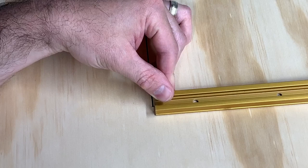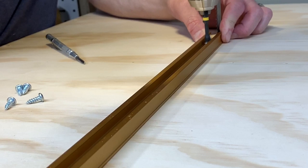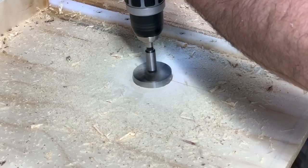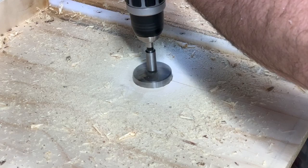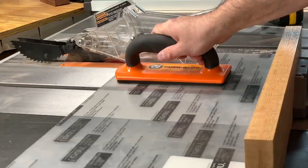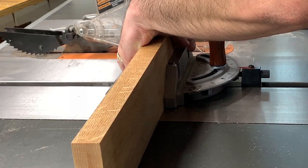To accommodate any future changes such as blade thickness differences or blade wander, I didn't put the T-track right up against the blade — I left a little room. I also used a Forstner bit to drill out a hole for dust collection, but once I installed the T-track I had to take it back off. To determine how wide the T-track section should be, I'm now making the slider mount from layers of plexiglass since I didn't have one thick enough.